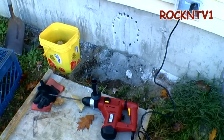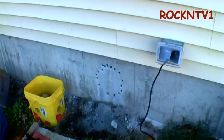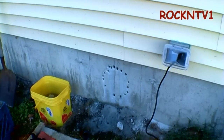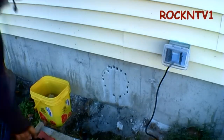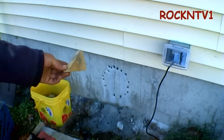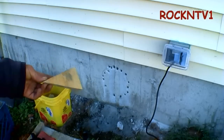So here we are at the wall with the Chicago Electric Harbor Freight rotary hammer. You can see my wall there — in about six hours, that's all I got done, and only about 70% of those holes actually go through the wall. It's eight-inch concrete, and I'm drilling on a 30-degree angle. I'm using this little wood block that I made to get my angle set with the drill against the wall. This hole is for a stainless steel chimney flue.